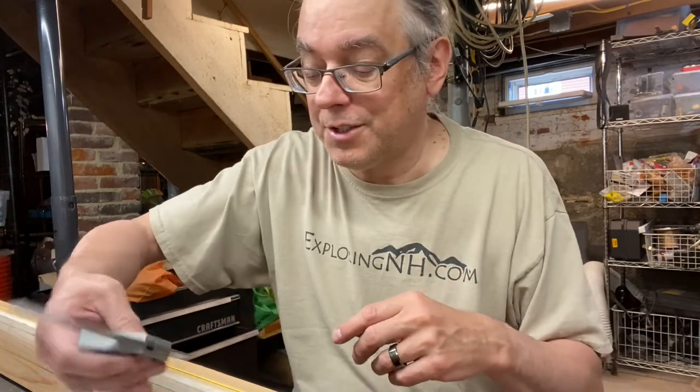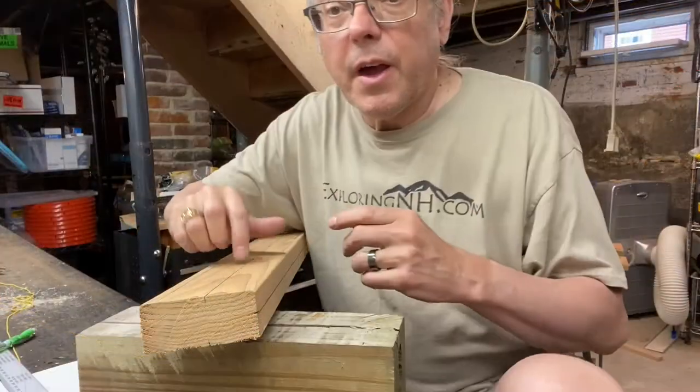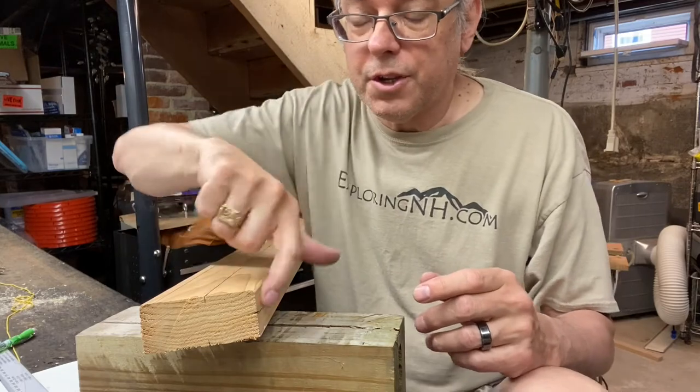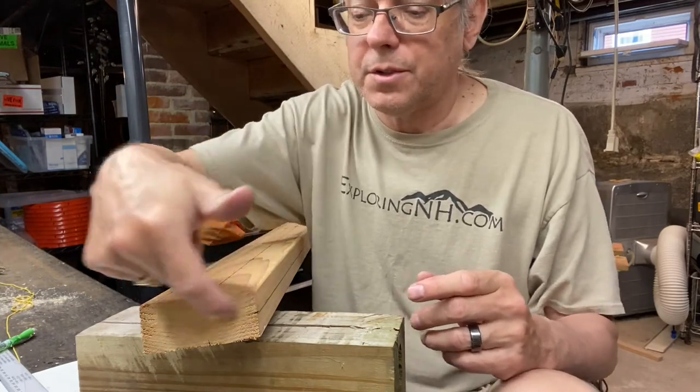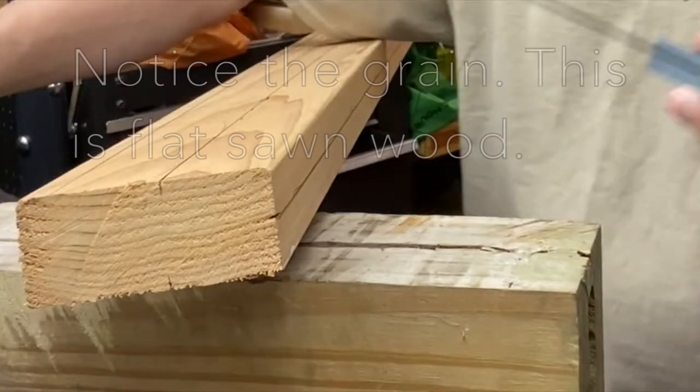So, yeah, I'd never done that before. That tip alone makes me happy that I'm doing it from the book, because all my other paddles, I just ran down and I would have made a nice curve to it. So I have the board marked on all four sides and the centers. The next step is to mark the edges. So you get your handy square out.